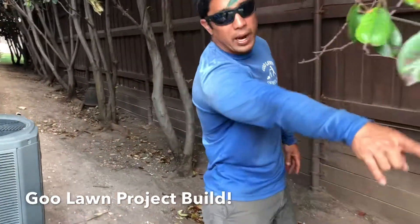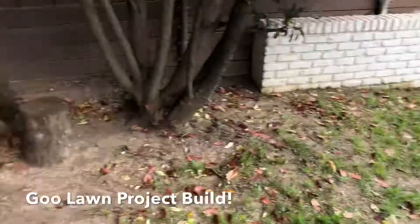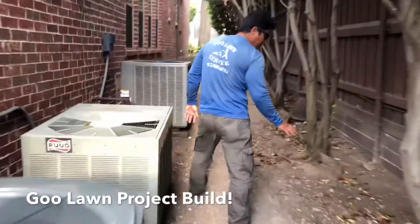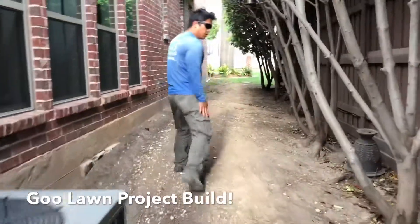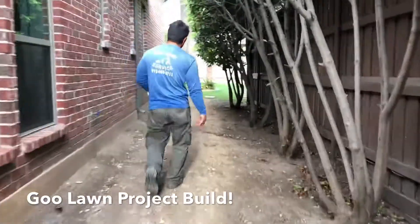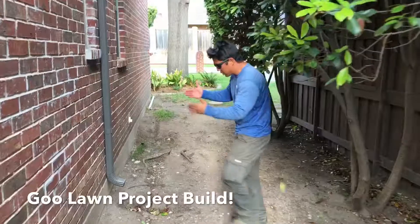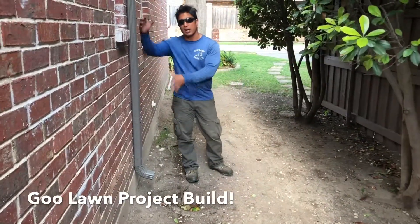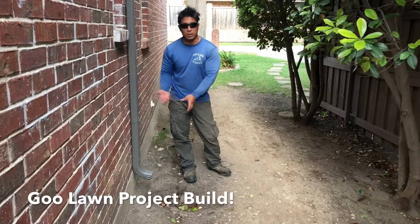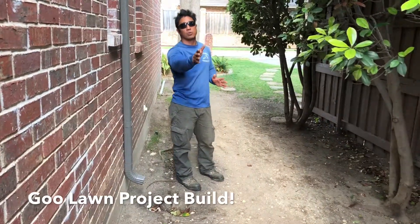We're going to run it all the way out through the bottom. If you walk along the way with me guys, you can come take a look - you can see we have to backfill everything over here. All this dirt needs to get re-drained and backfilled in. We're going to have to put down some weed barrier. You can see where the water is just pounding down from the gutter. We're actually going to tie the plumbing and the gutter into the actual drainage pipe that we're going to run about 50 feet all the way out to the street.